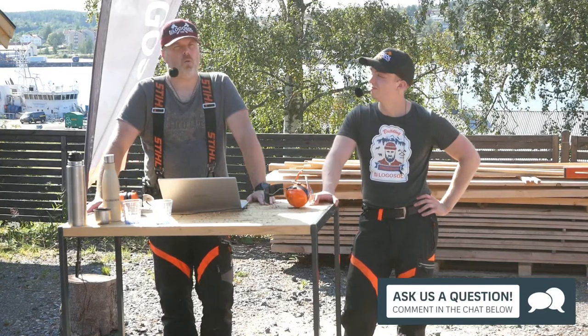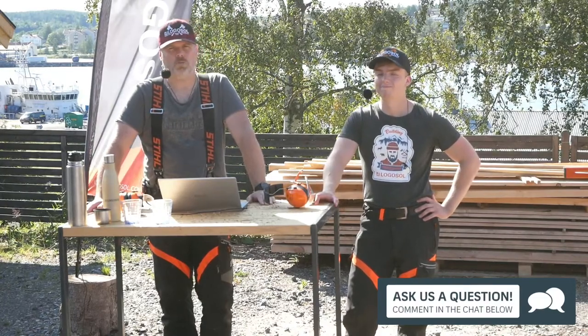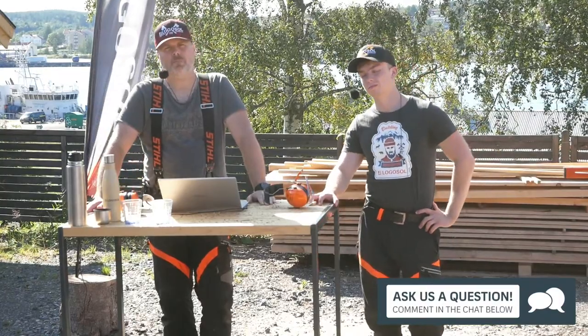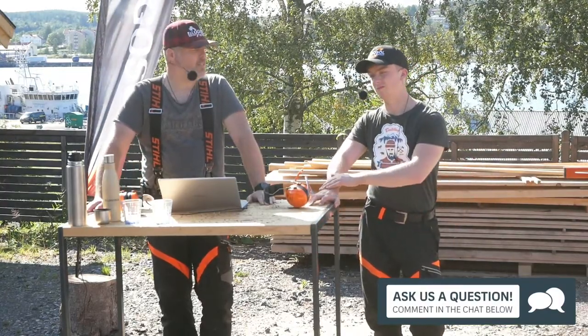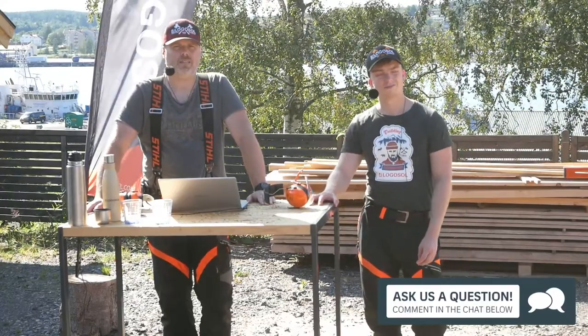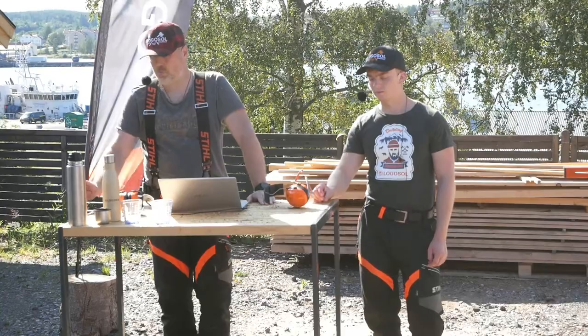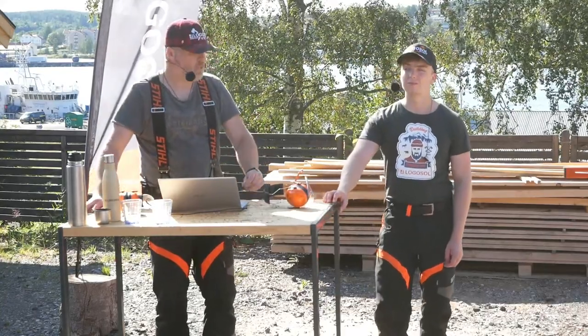At least if you are milling on the F2 and logs up to 20 inches, I would say go with the biggest possible chainsaw. It'll be more fun and easy to use. But at least minimum 60-70 cc's is a good number to aim at, and 4.5-5 horsepower.